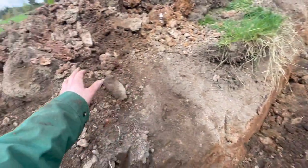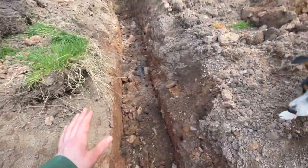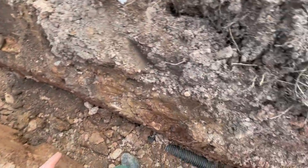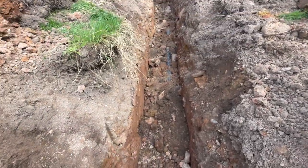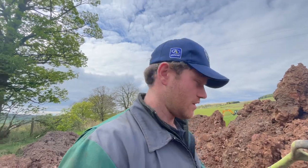Basically what I'm doing now is I'm filling in the hole with clay from the sides, or up here if I can't get it from there. That means that when all this gets shoved back in, it doesn't wreck the pipe because there's something supporting the pipe already and something on top of it. You can destroy a pipe straight away by not doing this. The right way is actually getting gravel but we don't have that with us at the moment, so this is what we're doing.